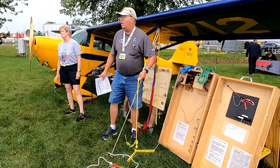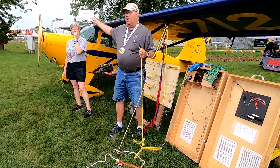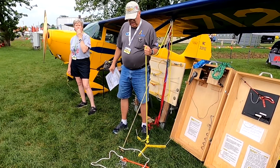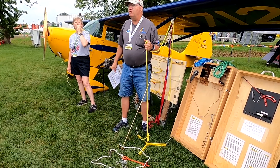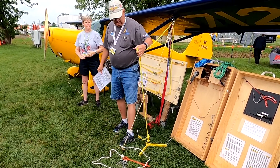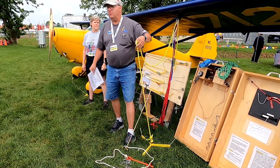How many of you are familiar with the claw? The manufacturer says pull straight up. A couple of years ago down here at the repair barn, they had a Cherokee 6 — pretty heavy engine — they needed the nose gear off the ground, they put one of these behind the tail, and it held the nose wheel off the ground. If you have to pull at an angle, pull out over one of the legs, not between the legs. That's how you get the best strength.